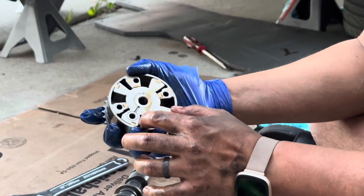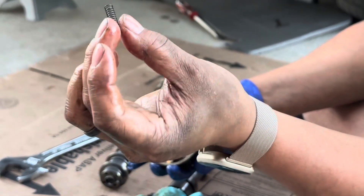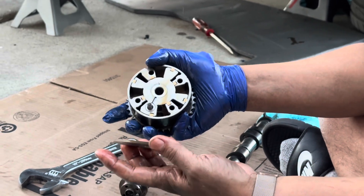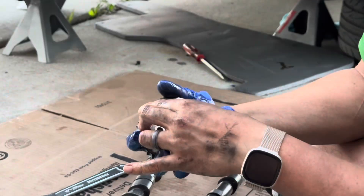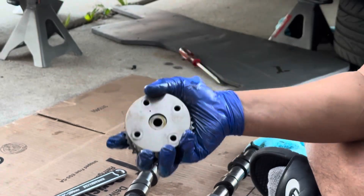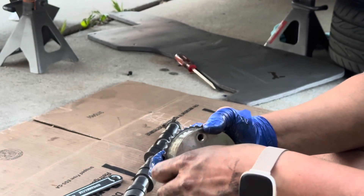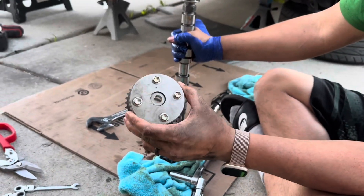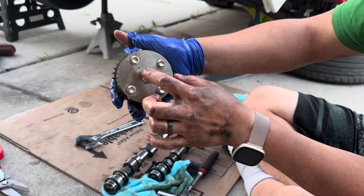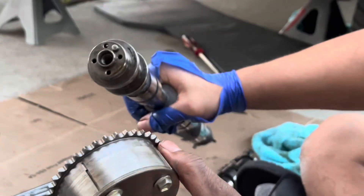Once this pin hits in there and locks it into place, the gear is locked. Go ahead and put this pin back — that's pretty much flush, so it should still be able to close. As soon as you rotate this gear it's going to go into the locked position. Take that spring and put it back on the locking pin to put tension on it, then place the cover plate back into position. Try not to rotate the gear sprockets because it'll lock again.